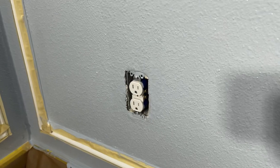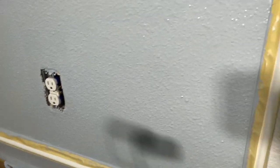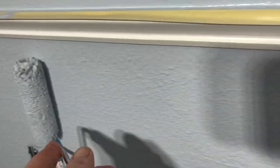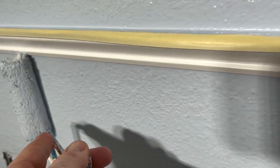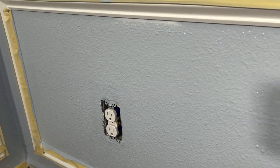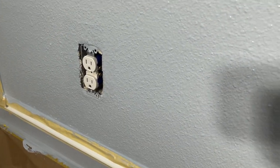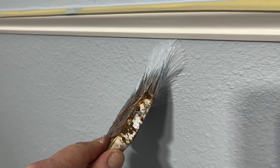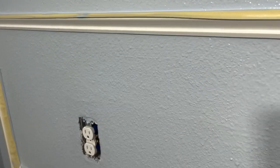So now, you saw me mash in the paint. And now I'm going to do it in one direction. I'm going to roll horizontally, simply because it's easier since I have this piece of trim here, and it would be easier if I just deal with it in one stroke. As you can see, that's because I'm holding the camera. I got paint on the trim. Not a good thing. Okay. So, but that's why I'm using the horizontal stroke, because it's easier to deal with this trim and keeping paint off of it